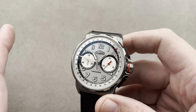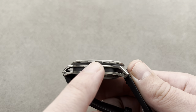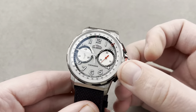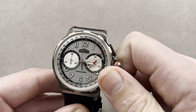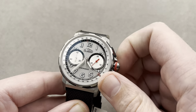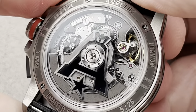If Arnold & Son is 700 to 1,000 watches a year, Angelus is going to be 70 to about 100, so exclusivity is high. This is a 42.5-millimeter grade 5 titanium case that has a canister holding the movement and dial made of carbon fiber inside. The watch features no shortage of luminescence, and true to its name it's a chronograph with a date. The watch features a La Joux-Perret caliber based on the ageless Valjoux 7750, but it's been upgraded — the finishing is entirely unique and highly stylized, and it's been converted to use a column wheel instead of the common 7750 coulisse or cam system. We still have the oscillating pinion lateral clutch.